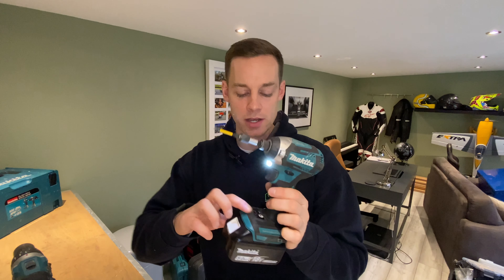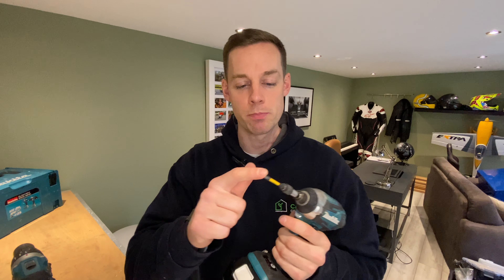They're really good — it's a bit less torque. You can control the power on this button here, which saves you blowing up the heads of the PZ2 screw bits. If you're using really powerful impacts, they just blow the heads. You get your 100mm screw halfway in, it pops the head, and then you've got to try and pick it out — which never works. You end up angle grinding it out or pulling it out and destroying the wood.